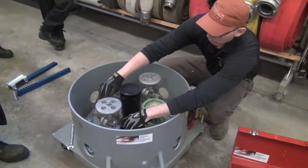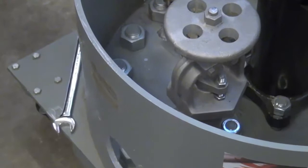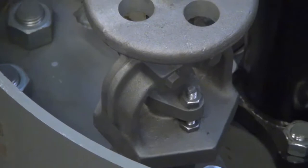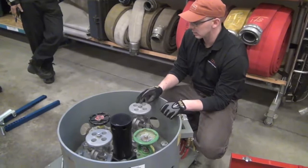On the older style chlorine valves on chlorine and SO2 cars, same idea - the packing gland is driven down by two nuts on the studs. Just tighten one and then the other down. Assuming the packing is not totally shot, you can almost always stop that leak. Whether the guy who comes in behind you can actually move the valve anymore is not really our problem - we just don't want the car leaking.